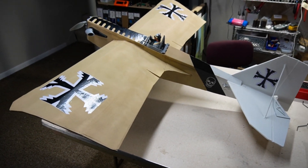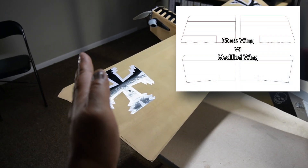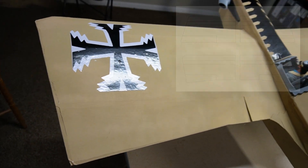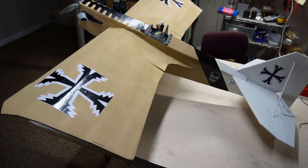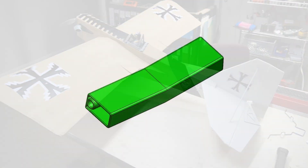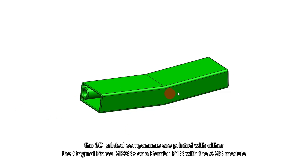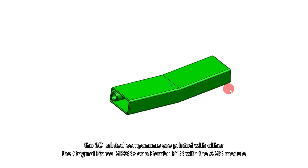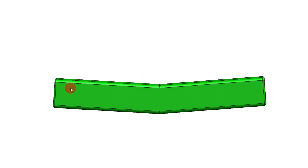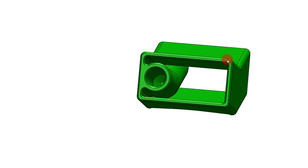As you can see, the wings are heavily modified — quite a bit wider at the tips than at the root. The original Scout wings were wider in the rear section, whereas these are wider up at the front. I wasn't sure what it was going to do aerodynamically, but the original was a great flyer and I just wanted to try something different. This is the 3D printed center support for the wing spar, which uses a combination of 3D printed Tough PLA and carbon fiber archery arrow shafts. I designed in an 8-inch dihedral, as close as I could determine from the actual Scout XL plans.